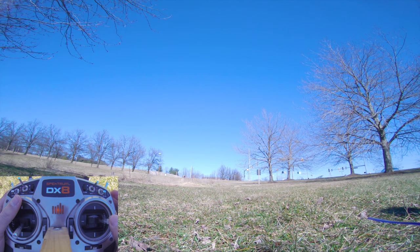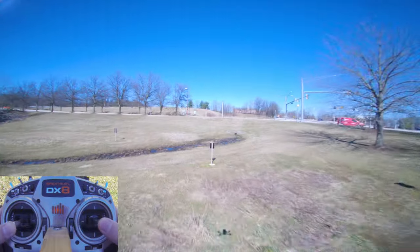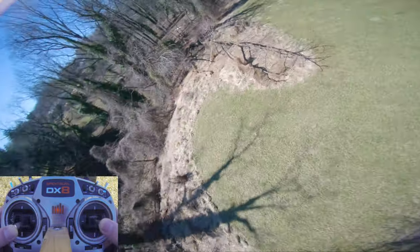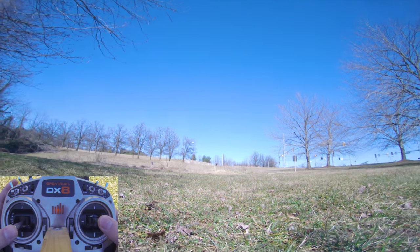I'm gonna go 65 on roll P, 50 on roll D, 68 on pitch P, and like 53 on pitch D. All right. Let me check the motors. Yeah, they're barely warm at all. Let me pay a little more attention to how everything feels.